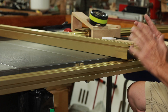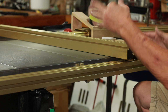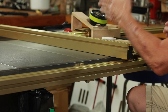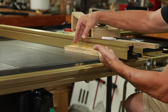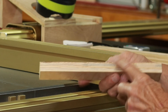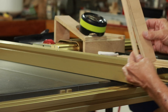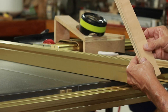I thought this was parallel with my miter slot. The third time, the first time I cut everything at two inches, measured it and dialed it in so it was pretty close to dead on two inches — within a couple of thousandths of an inch. This last time I got it all squared up and as I was cutting, I felt drag as the wood exited the blade. Right along here I got a little slight burn because on the up cycle of the blade as it exited, it was catching — it wasn't gliding through smoothly. Basically the blade was kicked in, so it was dragging as it exited. You're supposed to have a slight relief.